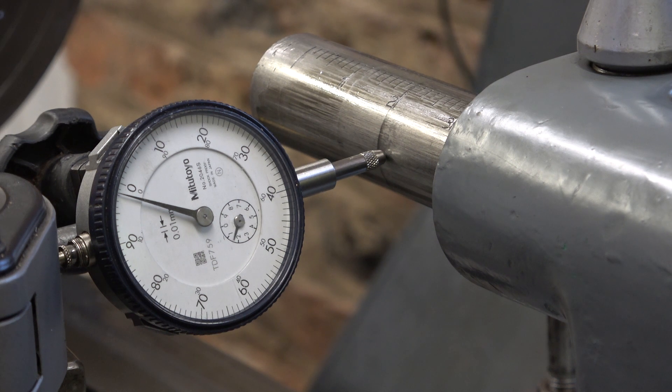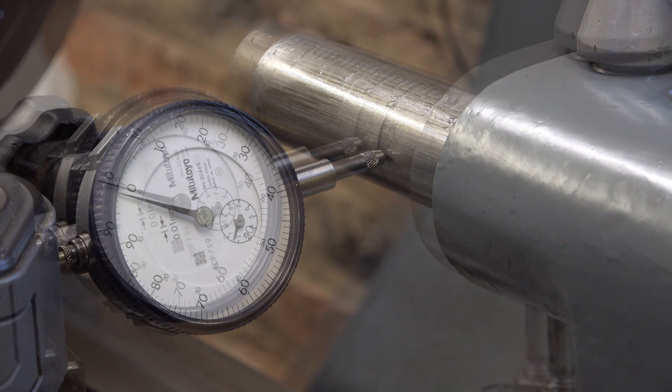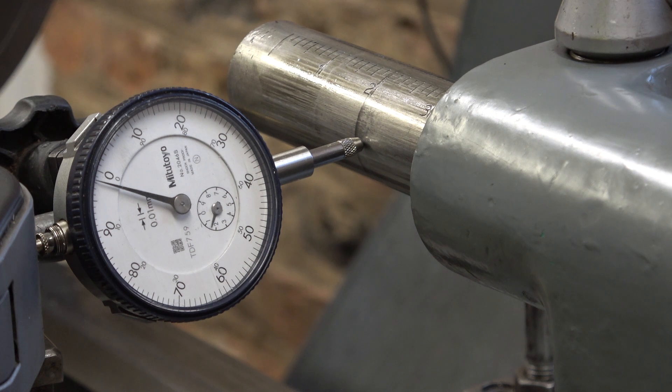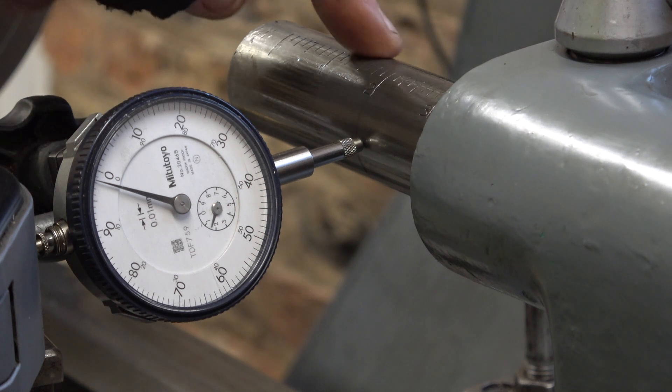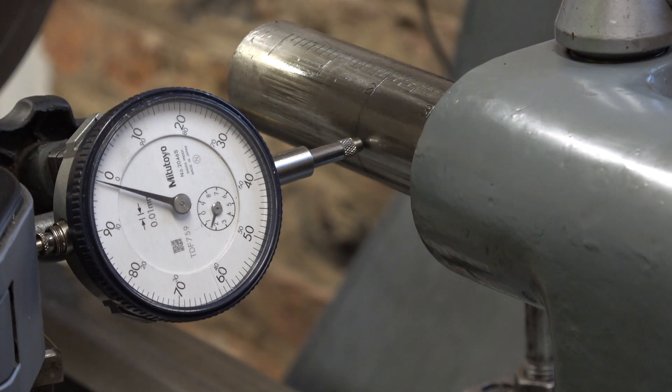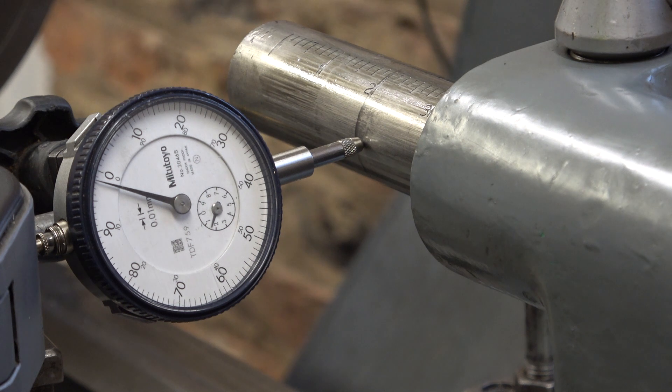So it's either in the bar or in the Morse taper, and it's probably just dirt. Yes, when I check it there is quite a bit of rust inside the taper back here, and there are one or two dinks as well. Now whether it's worth getting a Morse Taper 3 reamer and just cleaning that up — I don't know, I'd have to think about that. But now I'm going to try something else.